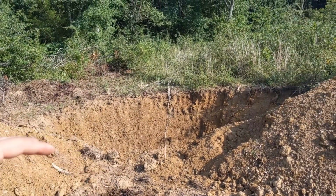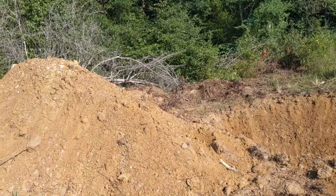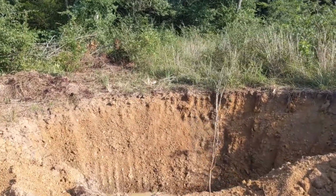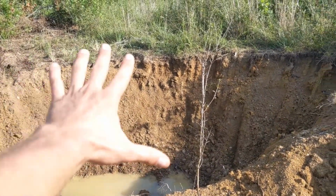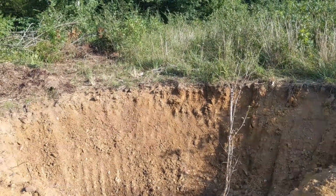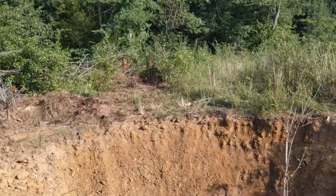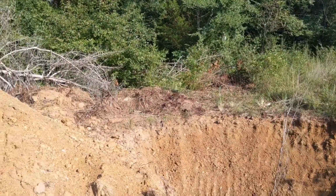Like I said, we're going to segregate the soil as I pull it out. All of this topsoil is going to go into one pile, and the shale that I dig out is going to go in a different pile. Eventually I'll line all the walls of the pond with that shale, and that'll make it more waterproof. We're also going to build this area up. So that's why we're holding off on digging any further.